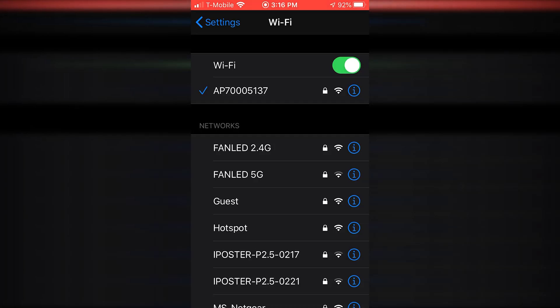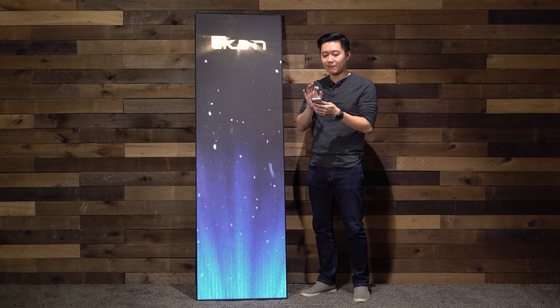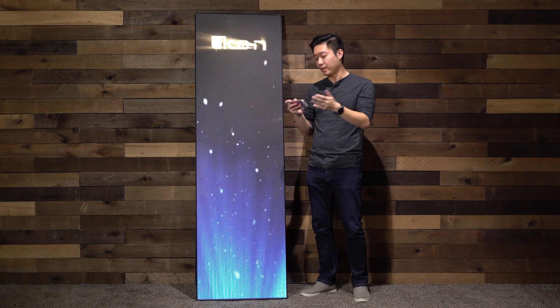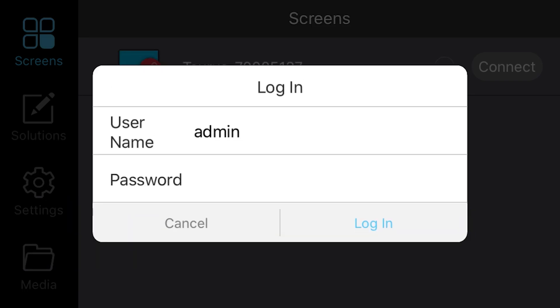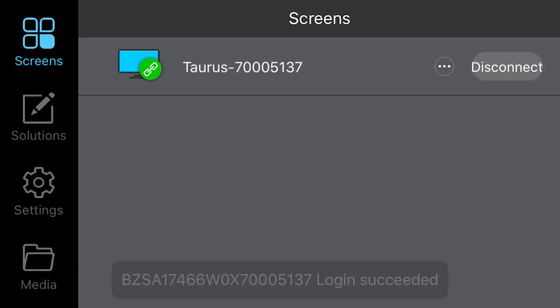You can go ahead and open the app, Viplex Handy. Once your phone is connected to the LED poster's Wi-Fi, open up the Viplex Handy app — there will be a link in the description below. Once you open the app, you get a chance to log into the screen. Don't worry, you can change the password later. Click connect and by default put in admin, with the password 123456, then push login and it'll be connected. When it's your first time logging in, you'll be prompted to change the password.